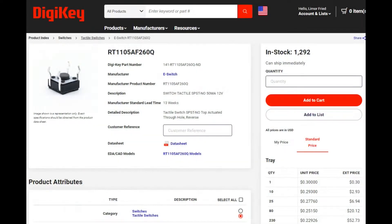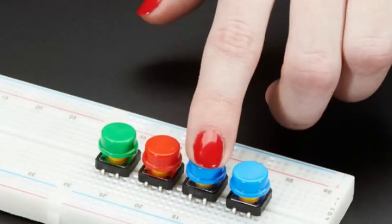Works great. Another neat thing is there's also a reverse mount through hole version. In that case, you'd definitely need some actuator that goes down and clicks it, because otherwise your finger would bump into it. Usually when you have a user panel, the caps would be held by the front panel, kind of floating in place like a game controller, and then there would be a little knob that goes down and clicks the tactile actuator itself.